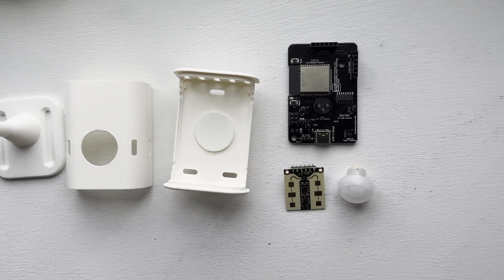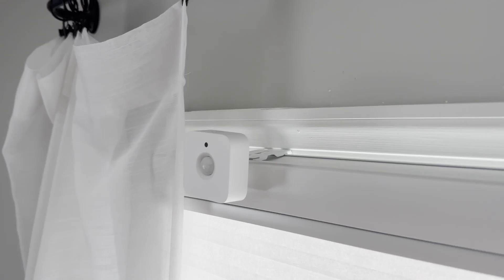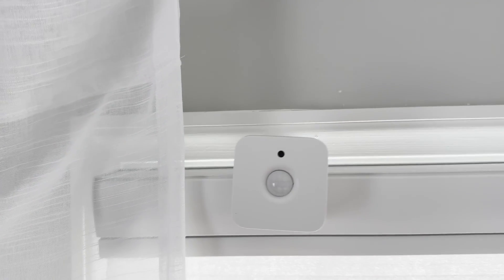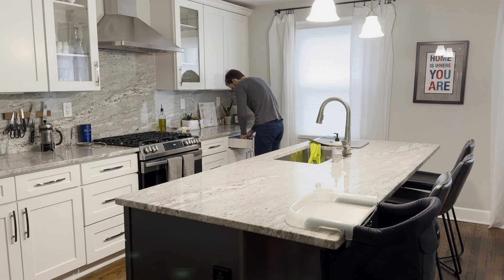If you're just starting out with smart home sensors, here are some tips to keep in mind. Remember the power of sensor combinations. Many smart home sensors often come bundled together in a single device — for example, the Everything Presence One sensor includes motion, presence detection, brightness, temperature, and humidity sensors all in one. Also, some sensors just work great together, like pairing motion and presence detection: use PIR motion to turn on the lights and millimeter wave to turn them off. You may also use multiple motion sensors in a larger room where any one of them can trigger an automation to reduce lag.